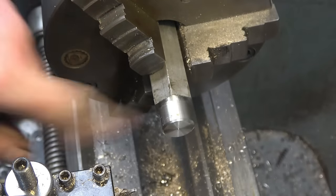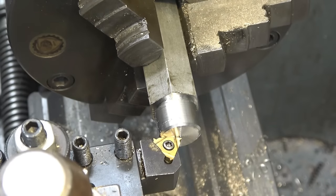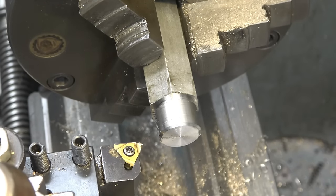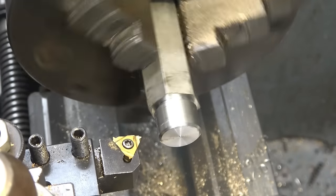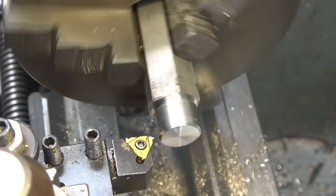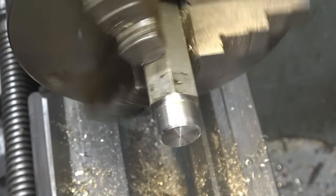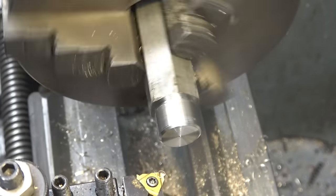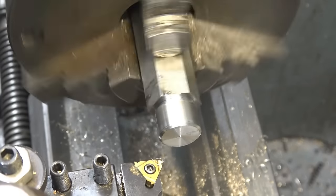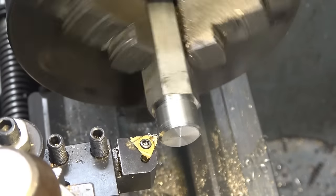Right, so we'll set a tool up into there, get that thread cut. That's a 14 TPI form tool on there, dead on centre height. Gearbox is still set to cut the 14 TPI. I'm going to slow things down quite a bit because we are going onto a shoulder. Just going to touch it off. That's the half nut. Engage the stop that way until the job's finished. I've got to stop it on the clutch. It's ideal, this machine, having the clutch out like a door with a start stop button.